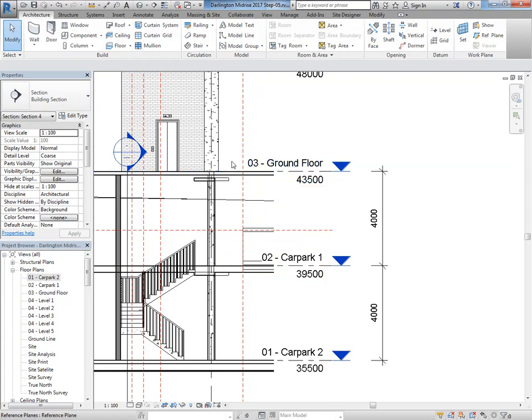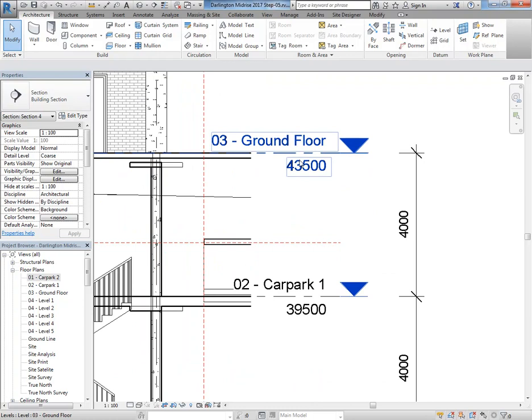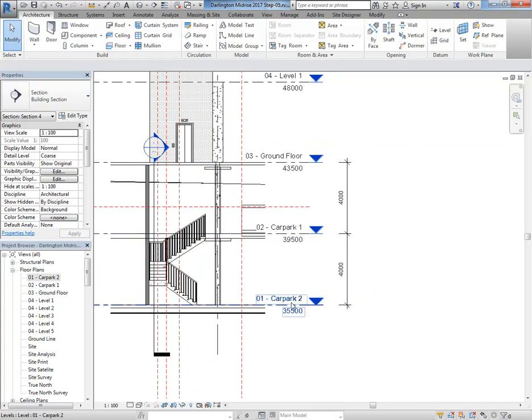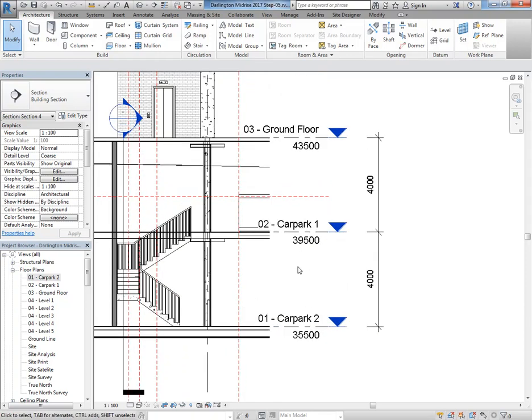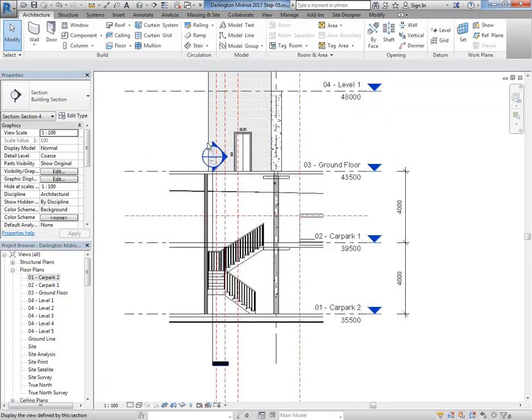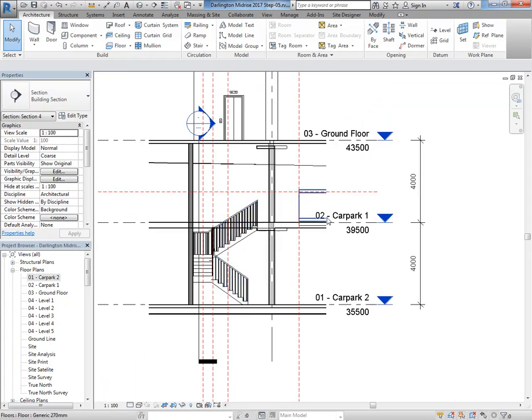What I'll be doing is leaving the ground floor at the height it's at, and if you can go down a bit further, just adjust the car park levels down from there. You've still got plenty of room for the ramp, so you can take it down quite a long way. You probably could take it to three metres floor to floor if you really pushed it and checked everything, but higher is better — so I'm going to do four metres floor to floor.